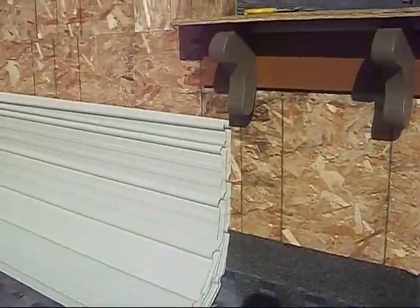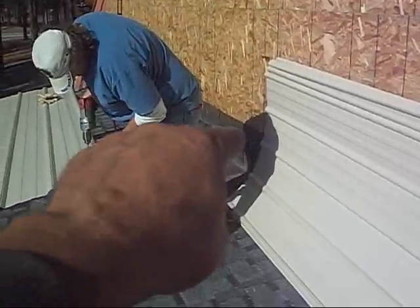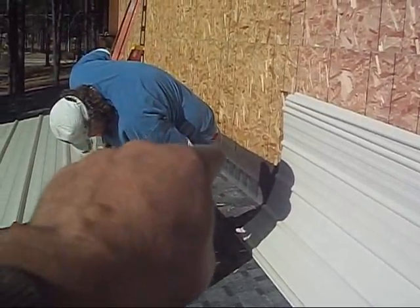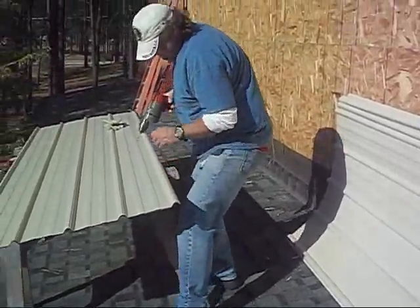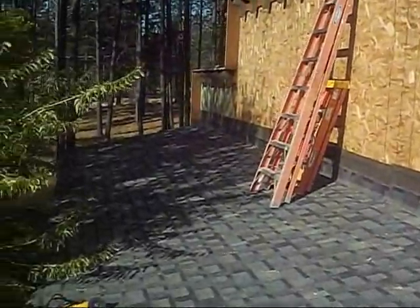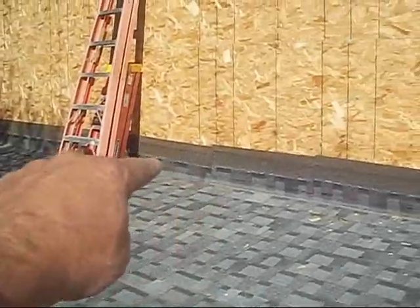All the metal is pre-cut. I ordered it that way so that the bottom of the metal is just about the top of that gray line of the shingles there, so those shingles up above will be the flashing. I think it's going to look nice and go pretty fast. Standing over here on the scaffolding you get an idea of what I'm talking about — that gray line right there is where the bottom of the tin will be.